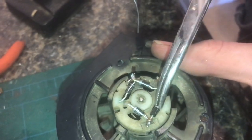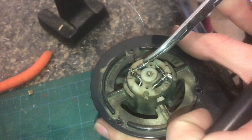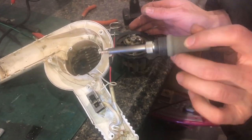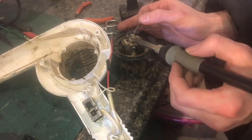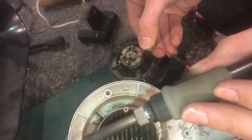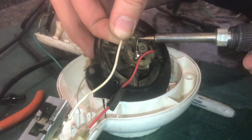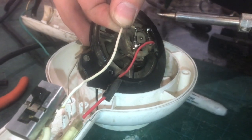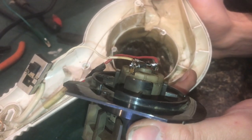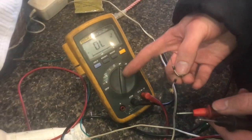The next step will be to orient all the diodes and get them ready to solder to my AC input wires. I'm ready to hook up the wires — at this point it does not matter which goes where because it's alternating current. Here's the first wire — I'll attach it with as much strength as I can. Now I'm ready to hook up the second wire.